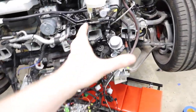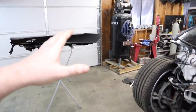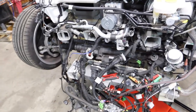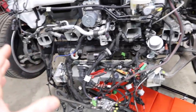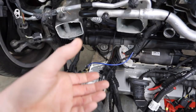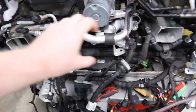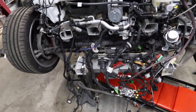Now it's time to move up front for some real construction — it's time to rebuild the front end of this Huracan. If you guys remember, there's kind of a box over here where the battery sits. So we went over to the green Huracan, specced and measured everything out, measured the aluminum supplies we need, and called Metal Supermarkets to order our delivery, which will be here in a couple minutes. Basically the way this thing works is you have these two bars come to a union right about here, these two come to a union as well, and then there's a channel for a three-inch box piece of aluminum that comes out. This is also three by three down here, and then they have a cross support that goes up here and down below with a big flat face.